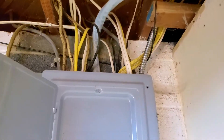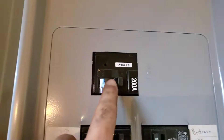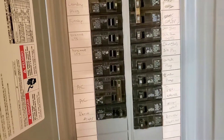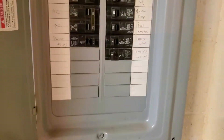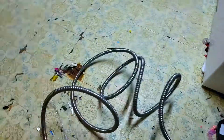Our house is a 200-amp service, so we have plenty of room to install our 50-amp connector. The hot wires come in through the top, so if you are installing this in your house, you should probably put the 240-volt plugs closer to the two main wires — that way there's less heat and resistance going throughout your bus bar. These are some large 200-amp wires, and this is our oven wire.